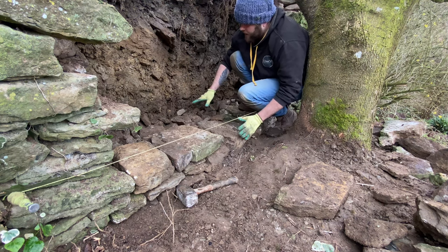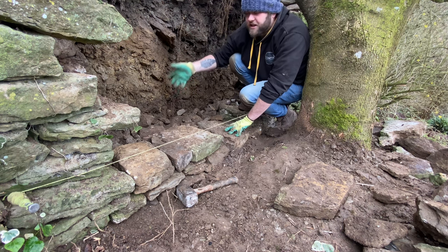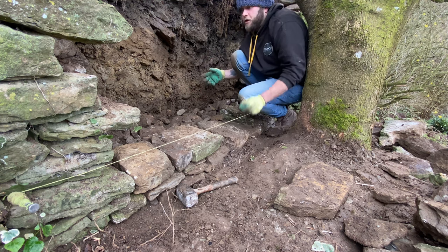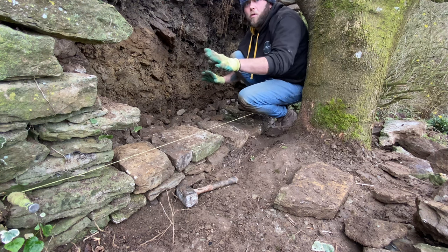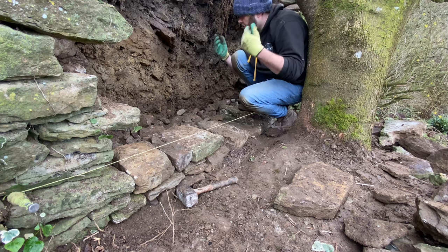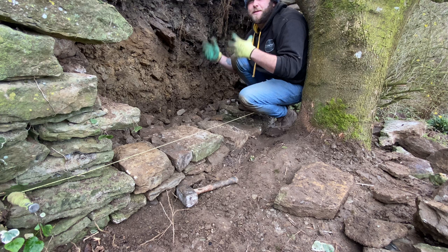But anyway, all tail stones in, and then at the back, I've just hearted it. If a dry stone wall doesn't have hearting and isn't well hearted, it is just going to fall down. Basically, you're reducing all that space. The less air gaps, the less gaps and space within the whole of the wall, the better. So if you tightly pack it and tightly heart a wall, and you've got the tail stones and you've got weight at the bottom, just those simple factors really.